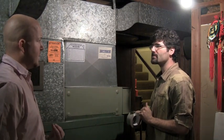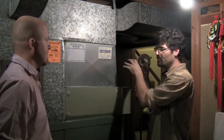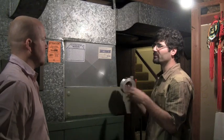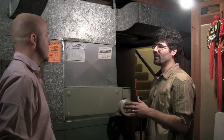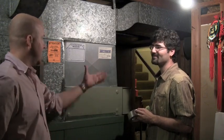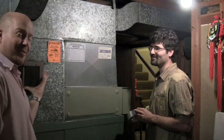The return is actually where the air comes in — it's returning from the house after it's been conditioned and coming back into the furnace. Some confusion comes from the word 'supply,' which is where air is being supplied to the house, not to the furnace. So the return is the intake for the furnace, and the supply is the heat going to the house.